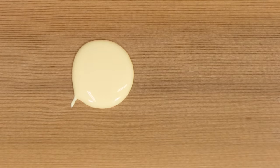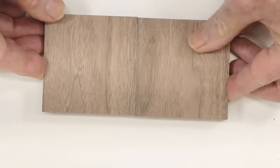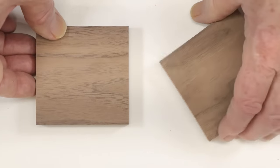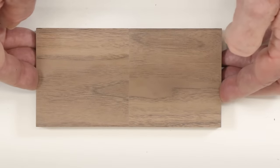There are three ways to glue two blocks together: side to side, end to side, and end to end. The virtue of this particular setup is that regardless of the grain orientation, the pair of blocks end up exactly the same size with the joint in exactly the same place. This lets us compare the results directly and fairly, without any calculations or adjustments.